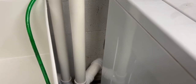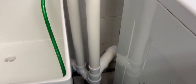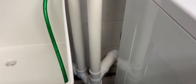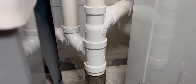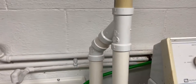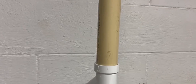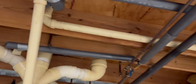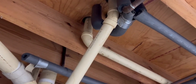Now, the washing machine trap is usually 2-inch, but some codes will require the washing machine stack to be 3-inch, so check your local code. This T goes into the T for the sink, and you can see that goes over, and the sink has its own vent, and then both these vents tie together with a Y that I glued on to the old vent line. This vent line runs along the ceiling, and then it goes up into the wall where it ties into the vent stack, which goes up to the roof. So this sink has a proper vent.